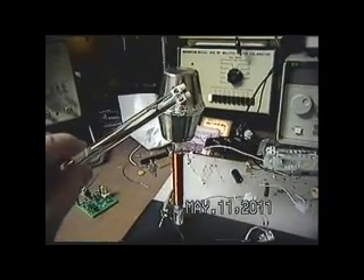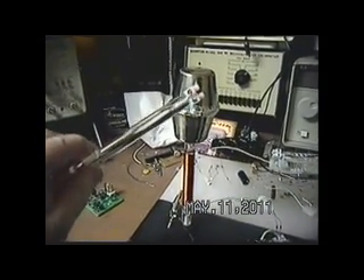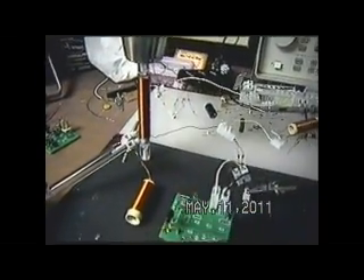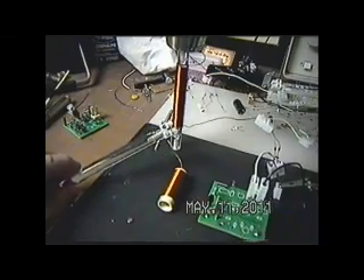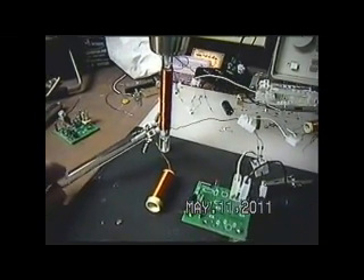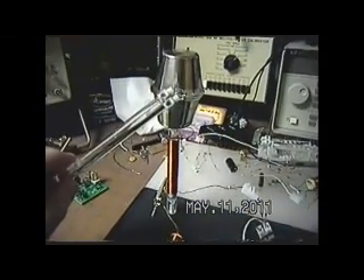This parametric oscillation is driving the L3 and causing the coherence. Since I played with it, let's come back now again. It'll drift in and out because that diode is fairly sensitive to temperature. And now you see we did at one time have a little signal there. Go back up here — and we had good signal there.